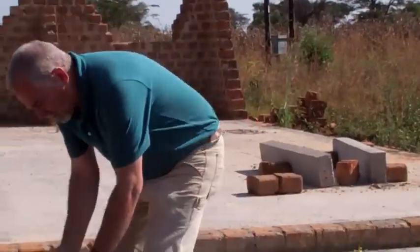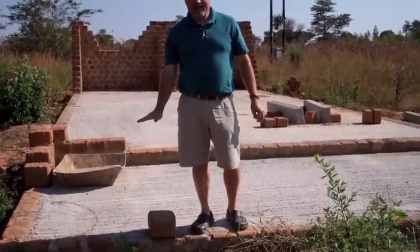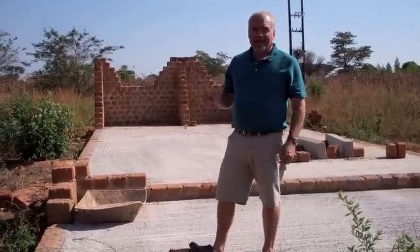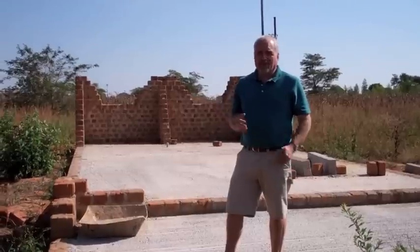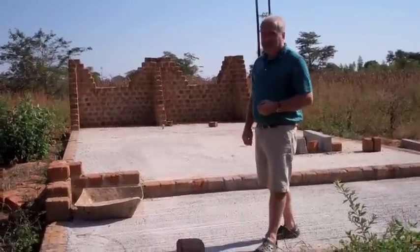If I lay this block on top of this one, it's a tight joint. And by the time you go about knee height, you can't kick it over — they lock together quite well. This is a good building system for unskilled labor. As long as the footers are dead level in all directions, this system works very well. Our houses this time will be using mortar between the blocks, and that will give us more of a 30-40 year construction rather than the 20-25 years we've been getting.